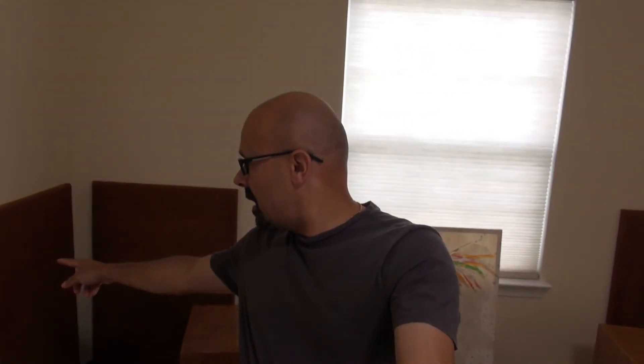Like I said, this is my first attempt at having a dedicated stereo room, and I am trying to tackle the subject of acoustics before I go spending any more money on gear. These back here are acoustic absorber panels. By rule, I should put one of them at the first reflection point, which I've marked right over here. When I did that, I really didn't like the results, so I need to treat this point with a diffuser instead of an absorber — specifically a medium curved cylinder-type diffuser. But there's one problem, so let's go to the computer and see what I mean.